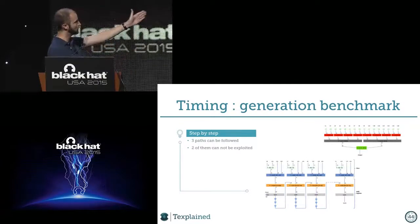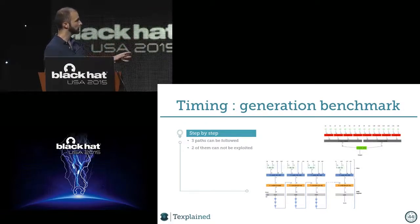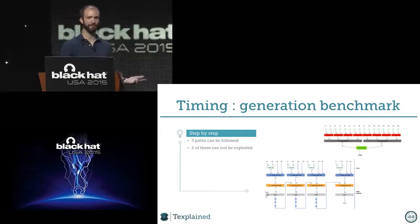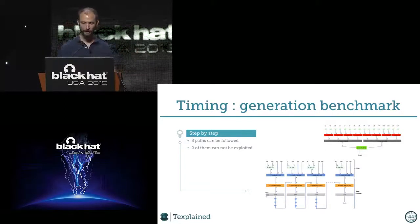So there was one, where you have 32 bits and you have some gates, and at the end of it, you have 1 bit. So it's hard to think that there could be an instruction register there because I don't know any 1 bit processor. The second path was a bit better. I like it, but we couldn't use it at the time. So we were finding multiplexers, and then we found some flip-flops, and in fact it was latches, okay, latches. And this could be it, but then we followed the output of the latches, and it's just like a chain. So again, it can't be the instruction register because you need to have the 8 outputs going somewhere in the instruction decoder and doing something, which was not the case.